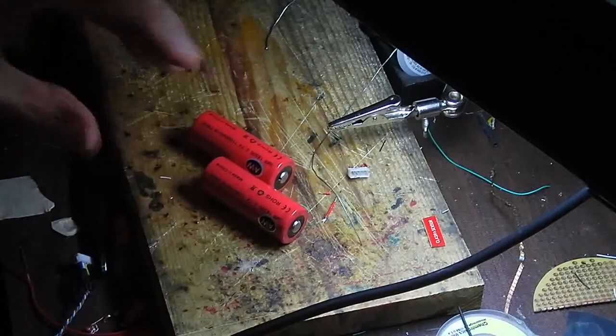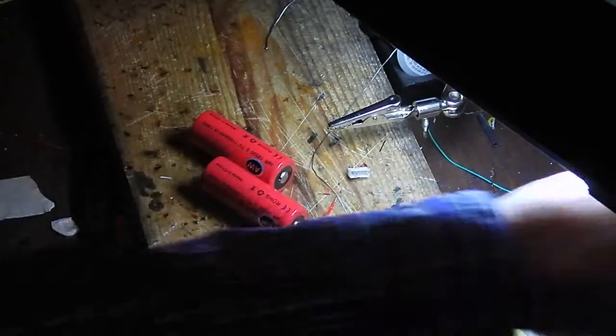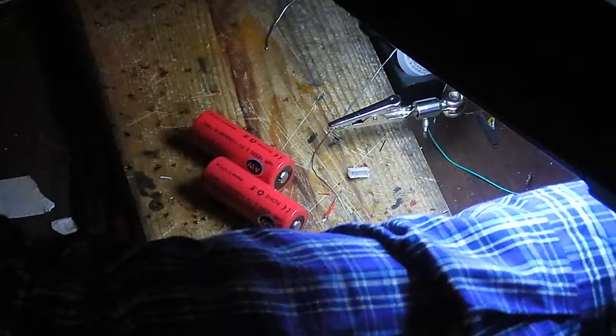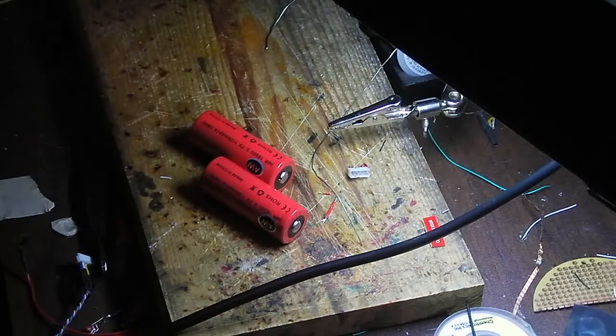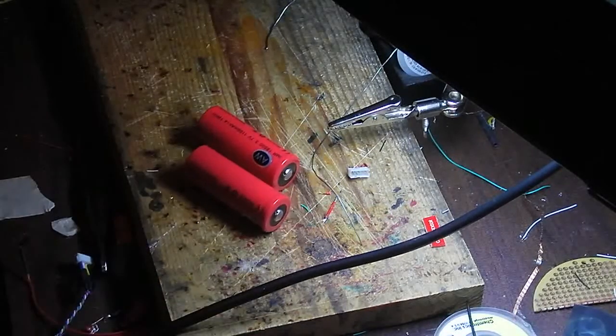The first thing you want to do is get your sponge — I've got a sponge, unfortunately not the brass, but if you have a sponge, get it wet. If you have brass you're ready to go. Get the soldering iron on and get it up to 400 Celsius for this. When I'm doing batteries, I normally leave it at 350 for every other type of onboard soldering I do.